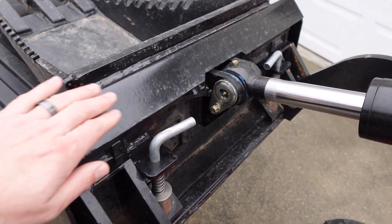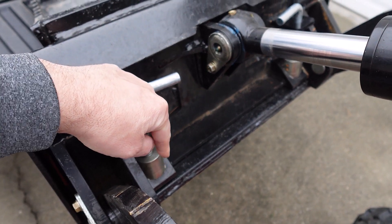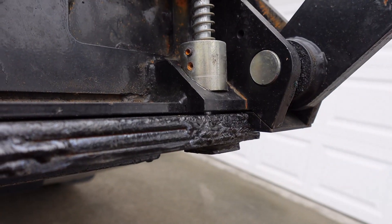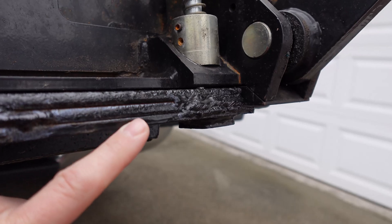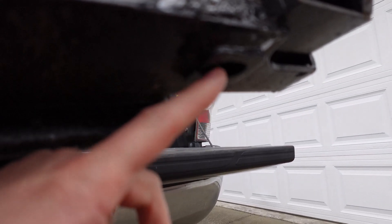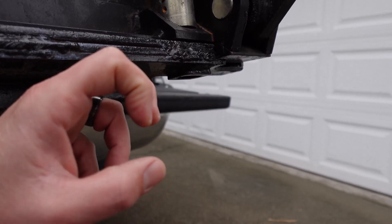Once I got the top plate making good contact, the next problem was the pins. The pin width was fine, but the length of the pins and how well they engaged in the original plate hole — it was just barely hanging on, with a lot of play. Looking at the right side, you can see it looks like three plates stacked on top of each other — the bottom one is original, the two on top are the modification. That pin was literally only in there about an eighth of an inch, so I had to get some extra metal in here so the pin has more meat to keep it in place.